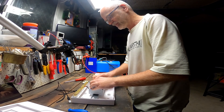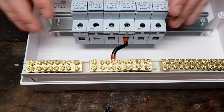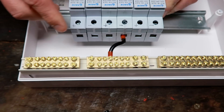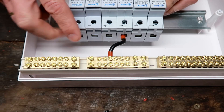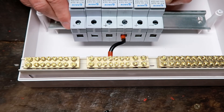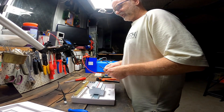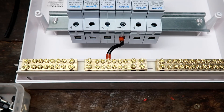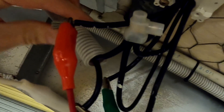It's 9:30 PM and I'm starting a new project — a little switchboard configuration. We've got six fuse holders in here, for two or three solar strings, positive and negative for each. The solar string goes onto bus bars and from there to our charge controller. This fixes the problem I currently have on my garage roof — we still have all the crocodile clamps connected to our solar panel strings, connecting to the bare wire feeding back to the solar charge controllers.